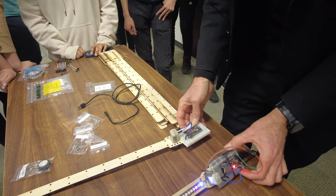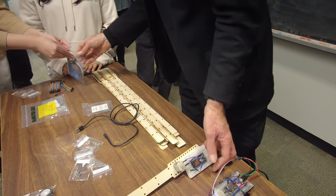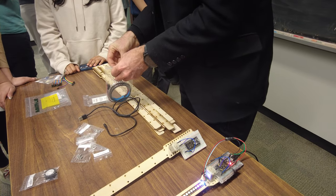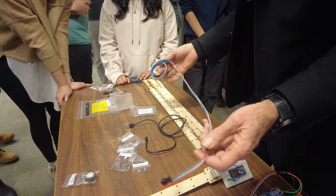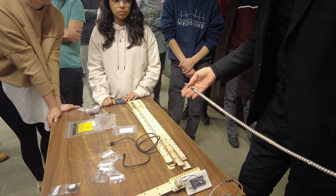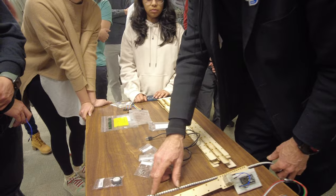Then take your LED strip — there it is. Connect it up. Remember there's a directionality to the strip, so be very careful and don't bend it too much or knock it around. This is the join in the middle.